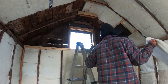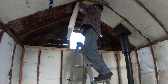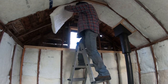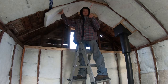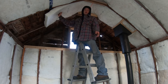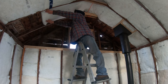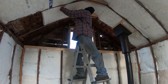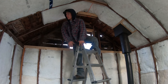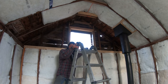I'm overlapping the insulation right over top of the ridge because it's one less sheet to cut. Not all the gaps are the same — sometimes it's not a snug enough fit, but it still insulates fine. I just put a piece of tape on a couple of them to hold them there until we put on the vapor barrier, which will then hold everything into place. Just got a couple more here, then the gable ends and we're good to go.